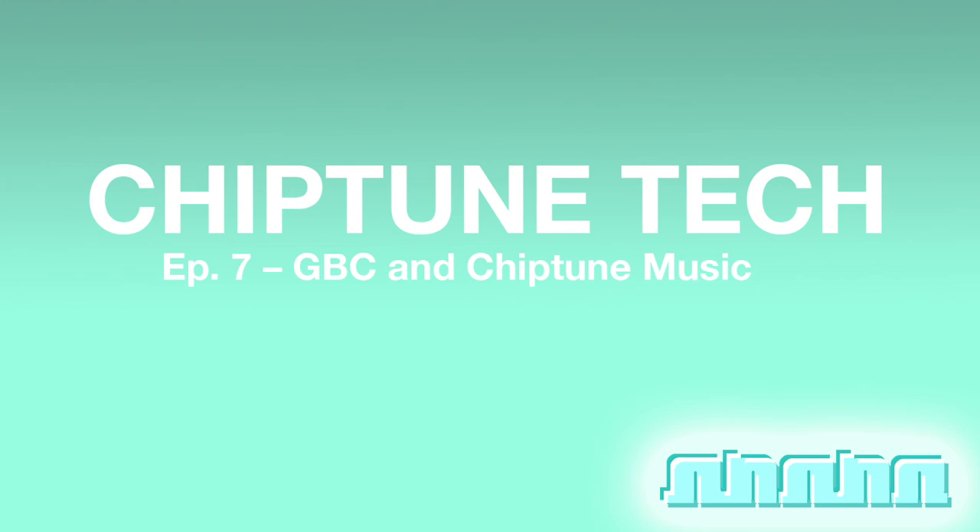The proper way to solder or desolder SMD components would be to use a hot air reflow station or rework station, which blows hot air through a metal tube so you can get the solder to its melting point and remove components with a suction tool or tweezers. You don't necessarily need a hot air reflow station — you can use a soldering iron with a small enough tip, and flux helps a lot with removing extra solder or attaching really small SMD components. I was a complete noob back in 2011, but now I can solder SMD components no sweat. You just need to get that practice and confidence in — you got this.